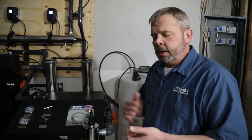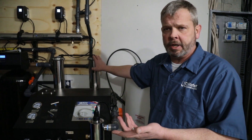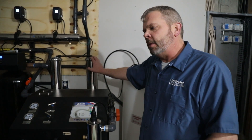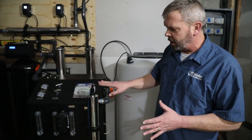Now that we've set it up at standard recovery rates, this is when we would go ahead and recycle some water, because we know we have fairly clean water going into the system. If you were on a well with 800 ppm TDS or more, I would not recommend recycling water — you'd save a little water, but you'd destroy the membranes by putting highly concentrated water back towards them. On lower TDS it's not as bad because the concentration you're putting back is fairly low. When you do it with high TDS, you're just destroying the membrane prematurely. So let's go ahead and do the recycling.